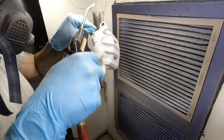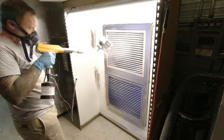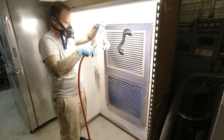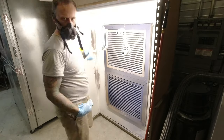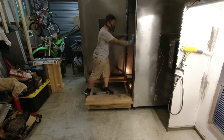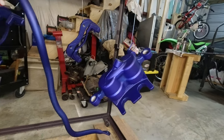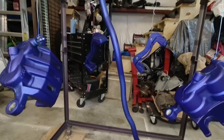Once again I'm using compressed air to blow out the places where I don't want powder. I ran them up until the parts were 400 degrees and then pulled them out of the oven and let them cool to room temperature. After spraying with the clear coat I'm going to put them back into the oven, run them up to 400 degrees, and then start my timer for the cure cycle — 10 minutes for this particular powder. See how that color completely turned blue. That silverish finish is gone. These things look incredible, and it's going to make a great statement behind the wheels I chose to put on this car.